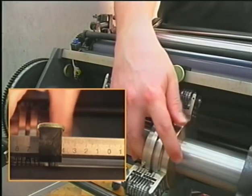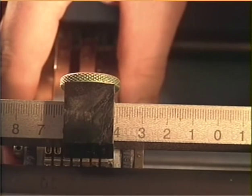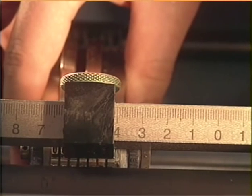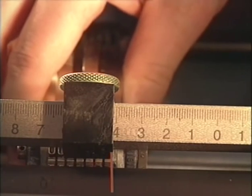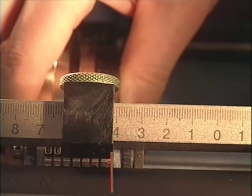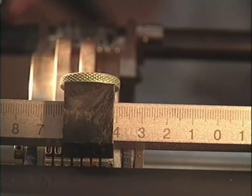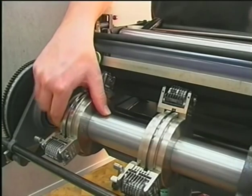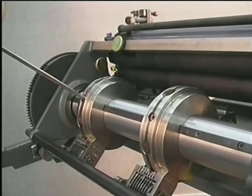The horizontal adjustment of the numbering boxes is done from the center of the sheet. Move the caliper gauge to the required position and align the mounting ring holding the numbering box. The adjustment is correct if the caliper gauge is in one line with the outer line of digits. Then tighten the mounting rings.